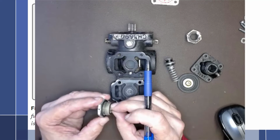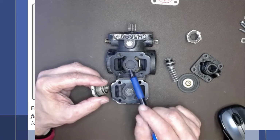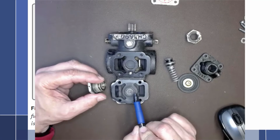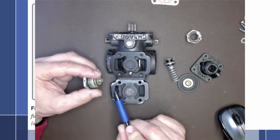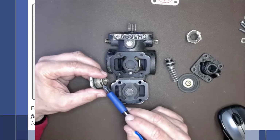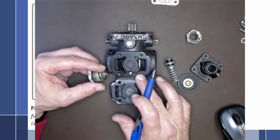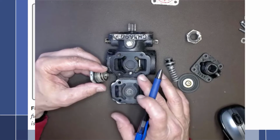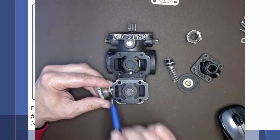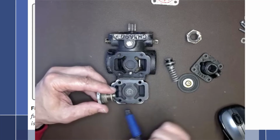Now it's going to continue to do that until the pump pressure here exceeds the boost pump pressure. So even if this was turning very slowly, it would not put out very much pressure. So this would continue to stay open as long as the pressure coming in this way was more. But once this pump gets going and it has more pressure than the boost pump, remember this is the outlet side now, so more pressure right here than the boost pump, that pressure is going to come back here, assist the spring, and now force it closed against the seat.